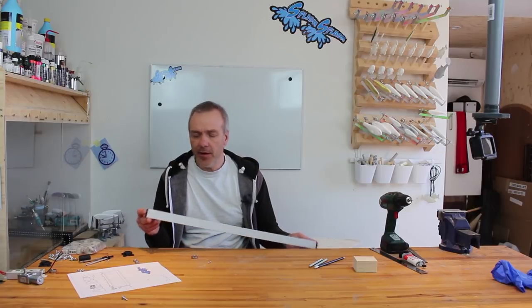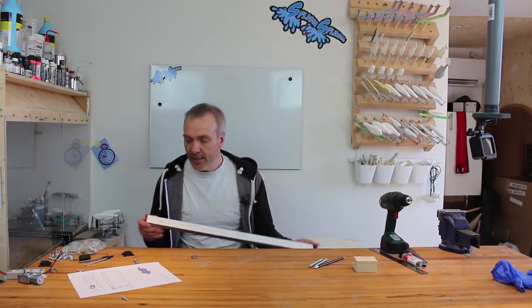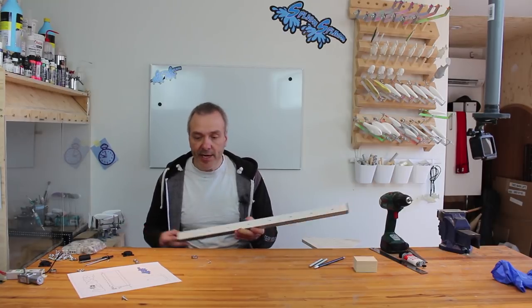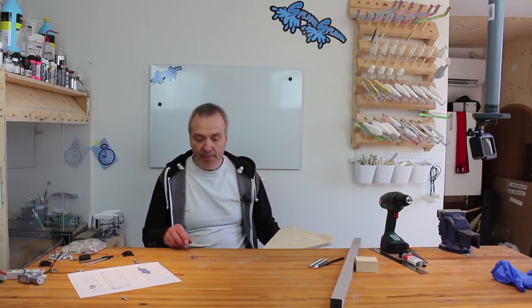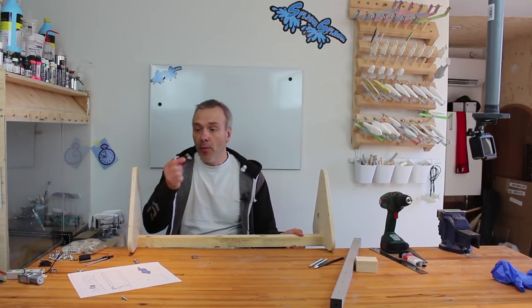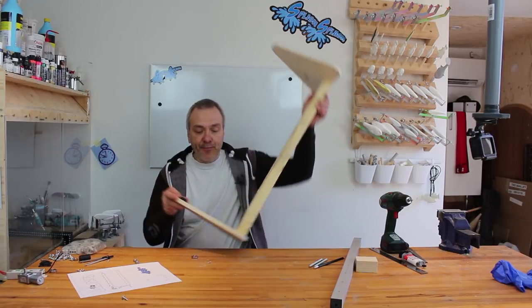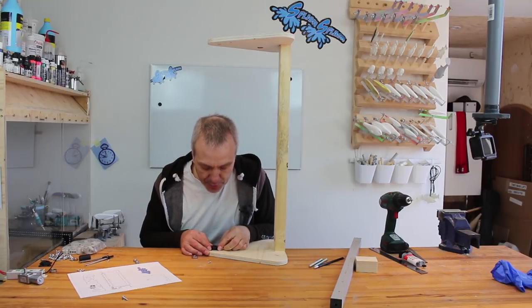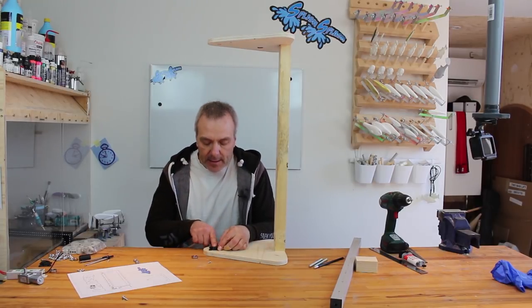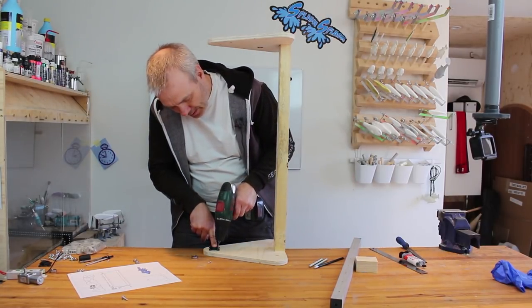The end of the axis is now firmly in place. The 5-minute epoxy has hardened, so this is firmly in place and ready to be installed on the dryer. Now I'll just need to screw those ball bearing holders I made on my 3D printer onto the frame here. So I'll just put them in the center like this, holding them down, and then grab a drill and just make some small holes for the screws.